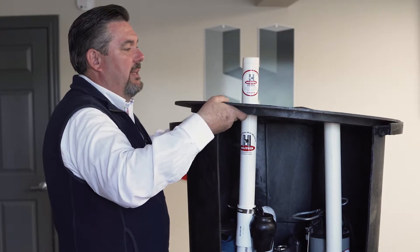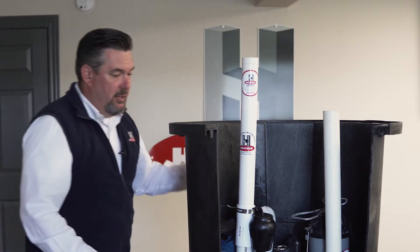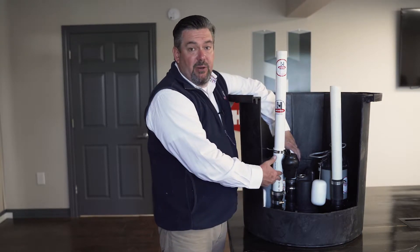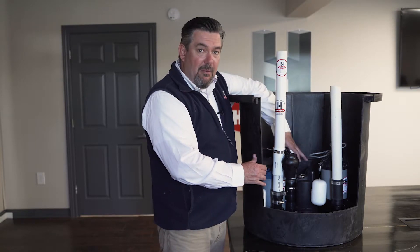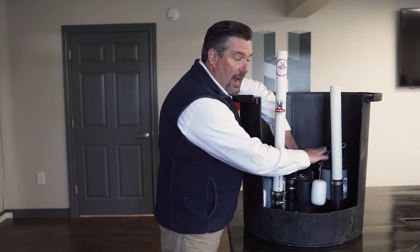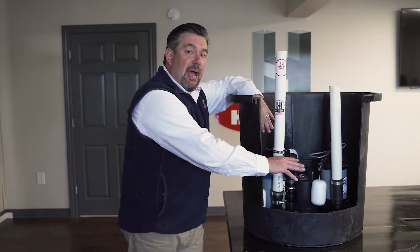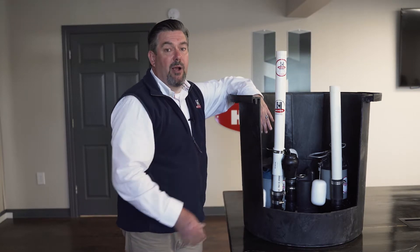As with the others, all of the lids are bolted into place for good secure locations. Each one of the S3s comes with your battery backup S2 pump system — that's a one-third horsepower submersible pump and a battery backup pump. We also add in another one-third horsepower submersible pump so that you've got a way to catch water during a really high rain event and get it out through not one, not two, but all three pumps when needed.